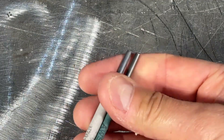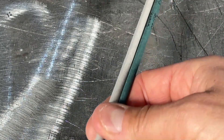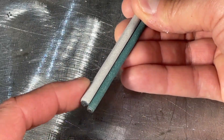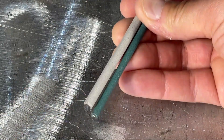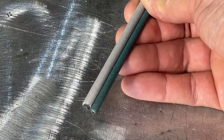Even though these two electrodes are the same in diameter — that applies to the core wire — when we look at the overall coating of that flux you can see that your 7018 on the left is much thicker than your 6013, and that's due to the high amounts of iron powder which is responsible for deposition, or the amount of material that can be deposited in a certain amount of time.